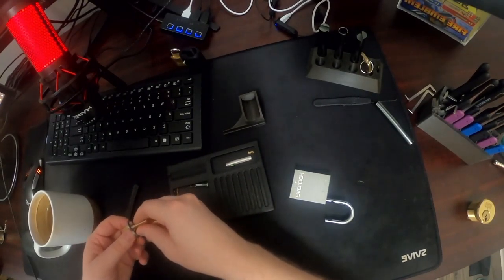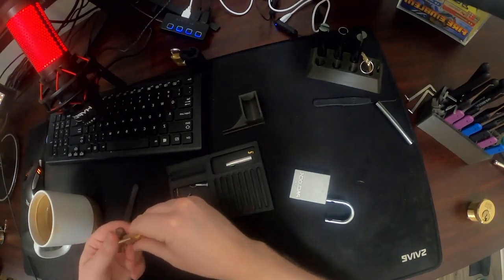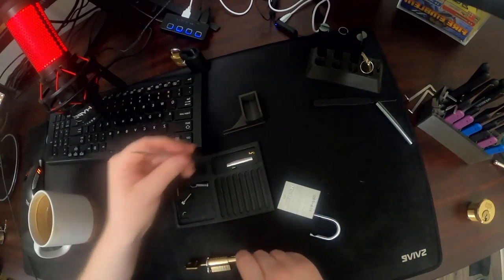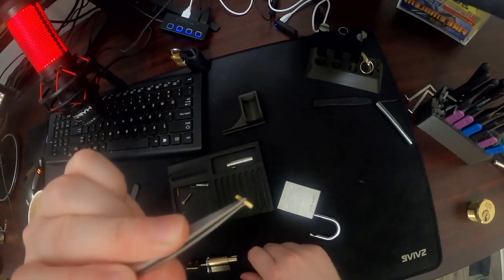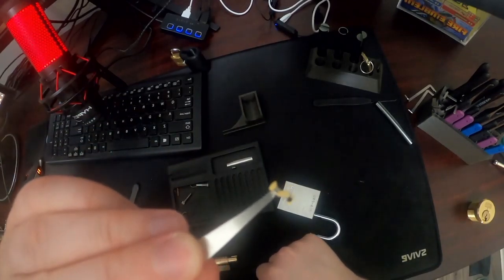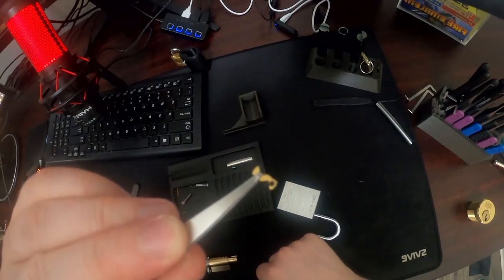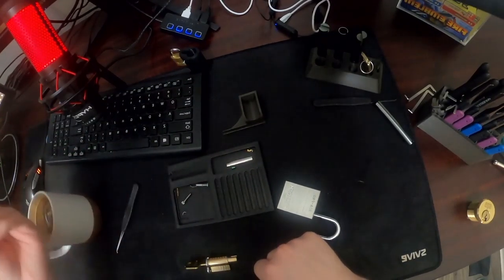It's actually a neat feature on that lock I showed you earlier that I said I keyed up for my parents' house. It has a little Z bar, actually it's right here, that you can put in or out. Can you even see that? A little better angle. You basically put that on the back of the lock cylinder, and if it's on there, then it'll be key retaining, and if you take it off, it's not. Oops.